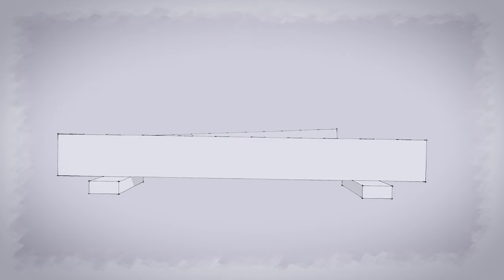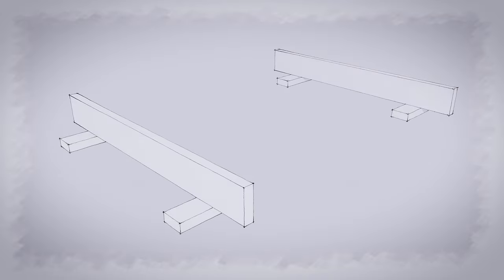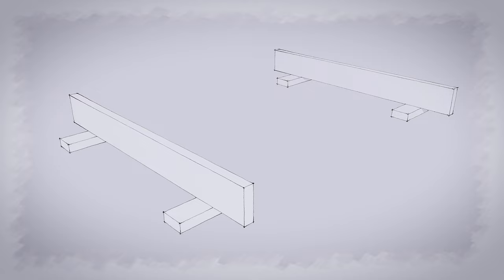And in hopes of making a nice smooth top, we need to make sure these risers are level across the top between the two. There's a few ways that I went about doing this. I ran string in a cross pattern. I ran levels on each. I used my eyeballs to sight it, and also a laser, and measured quickly for accuracy.